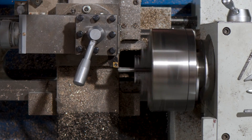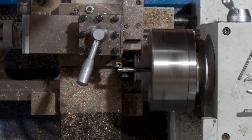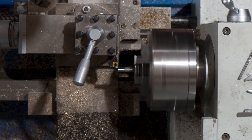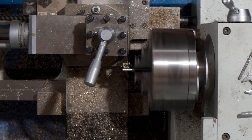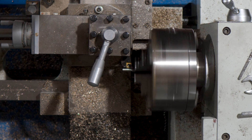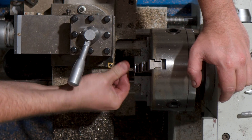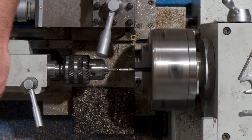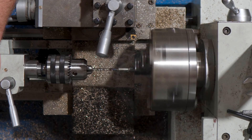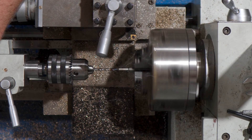And I saved the most exciting part for last — time for the handles and lead screws. Unfortunately the only bolt I could get my hands on was a stainless one that was long enough for what I needed, so it'll have to do. I'll turn down the end of the bolt to match the 6mm hole that I reamed in the brass pivot — this just needs to be long enough to fit through the pivot with a really small amount poking through. Then I'll drill and tap for an M5 bolt. I'm hoping that popping a small bolt in the end of the thread will lock the pivot in place, and the small amount of stick-out from the bolt will allow the thread to turn but keep the pivot captive. That drill bit is toast — I forgot to turn down the speed on the lathe when drilling one of the steel pivots earlier and she got hot. But we only have a couple of holes to go and it's still cutting.